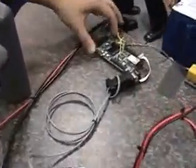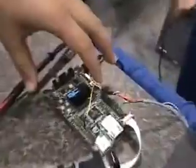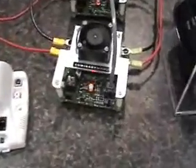So what we have is a Vex radio controller. I'm sure you've all seen one of these hooked into one of our Luminary evaluation kits called the 8962. We wrote a little bit of software that'll decode the remote signals and send out CAN messages to the Jaguars. And each Jaguar is hooked in through CAN in series, ending with this little terminating connector we have.